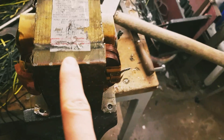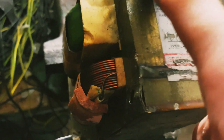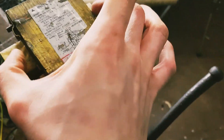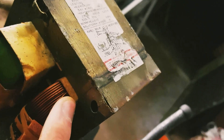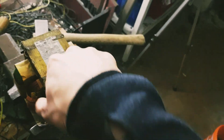As you can see, this transformer has two welds on top — this one and this one. You should usually ignore the first one, because it doesn't really do anything structural for the transformer. It's just there to hold all the layers together that the transformer steel is made out of. This other one is the important one, because there's a little slit — just the tiniest little gap — in between this plate of transformer steel and this plate.